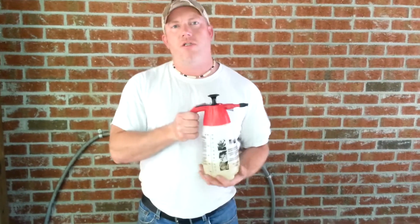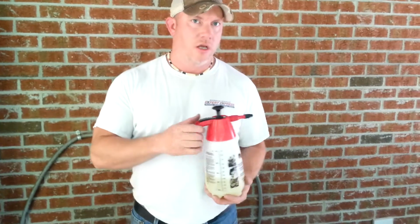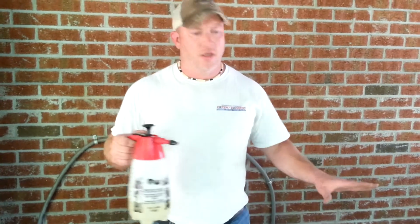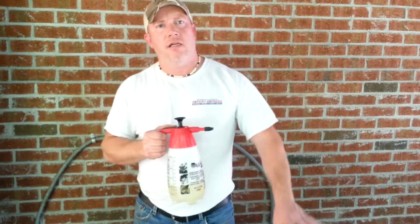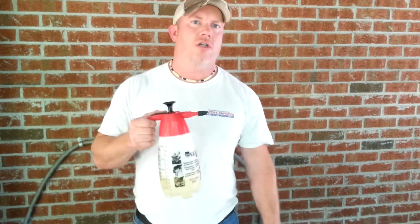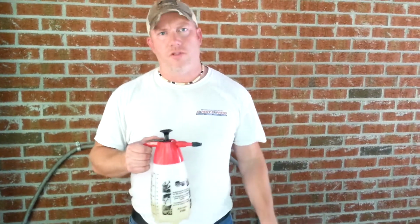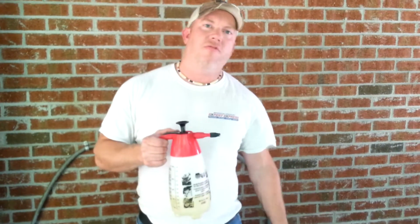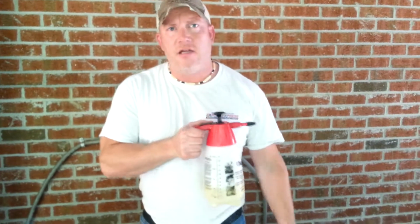All they do is just add refrigerant to the system. This is the most important thing out of all of this, because with dirty coils, the rest of your data is all bad. If you have bad data coming from your coils, bad data spreads throughout the rest of the system. You cannot have your refrigerant charge properly done with dirty coils. So even if they look clean, I always clean my coils so that I can be assured that they are as clean as they possibly can be, so that I can get maximum efficiency from the air conditioner, and also make sure that I have good data. Because with good data, I have good results. Bad data, you have bad results.